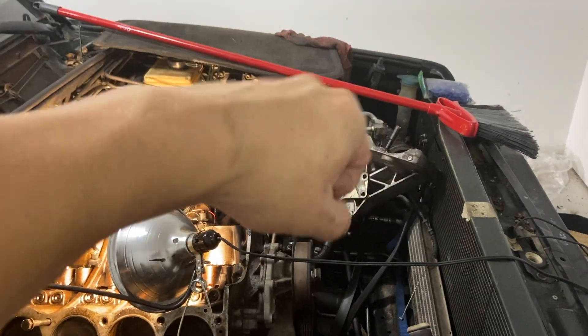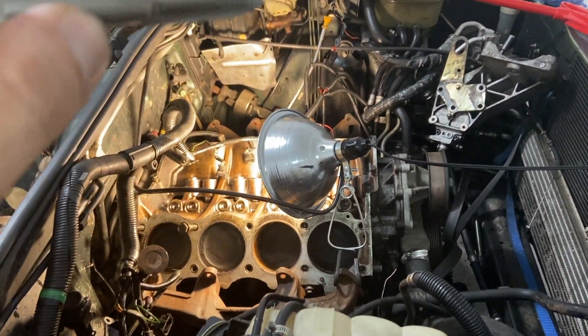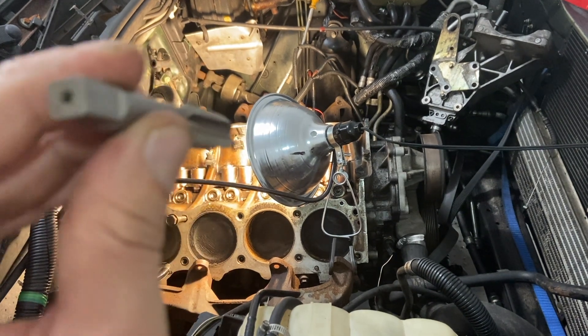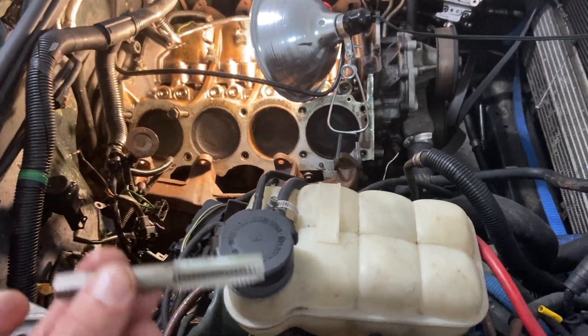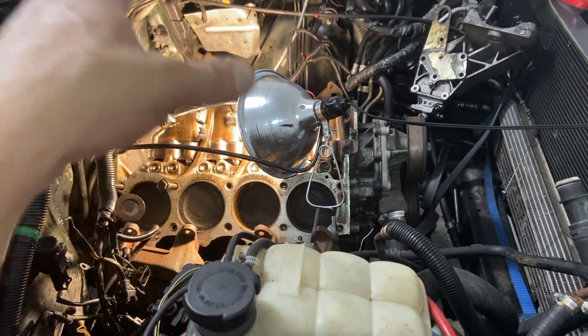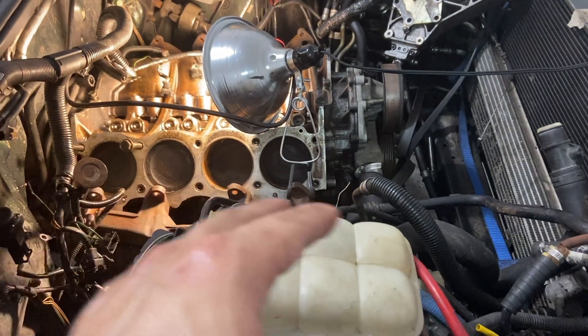This is all you really need to create a thread. There's another tool — it looks like a little key — but here's what you do: insert it in, make sure it sits even on all sides, then slowly apply pressure and turn it with your wrench while adding a little oil, stopping every once in a while to oil it. Now I'll be able to machine my heads, level them out, and put everything together with head gaskets. I'll put the tool list in the description. Thanks for watching — any questions, just let me know.